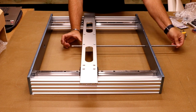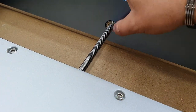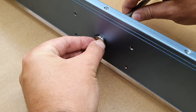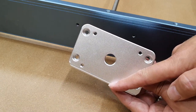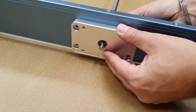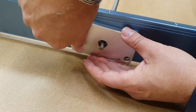Make sure the lead screw is sticking out by quite a bit. Take one of the bearings and slide it over the small end, making sure it is sitting in there comfortably, then slide the carriage forward until the bearing goes into the seating hole. Take the other bearing and slide it over the opposite end and push it into place until it's sitting nice and tight. Next, bring in the bearing fixing plate — the line indicates the bottom, and the larger hole goes against the blue plate. Place that in position and then bring in four M5 16mm bolts for the outer holes and tighten everything up.